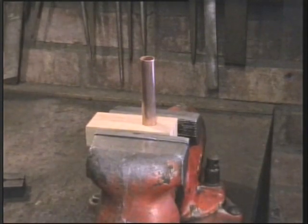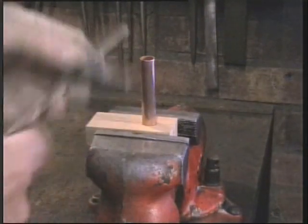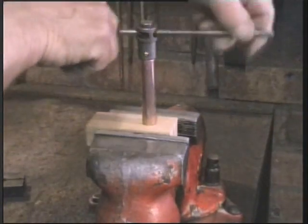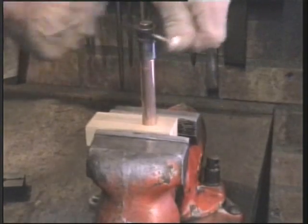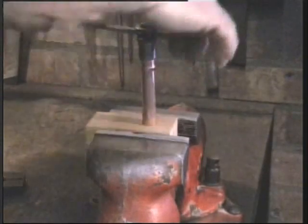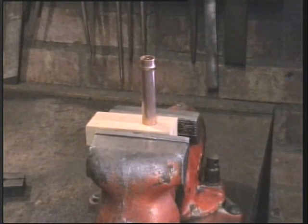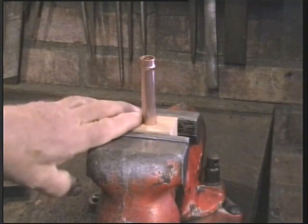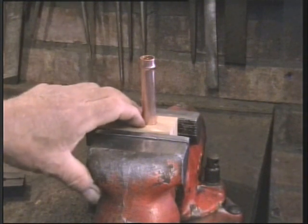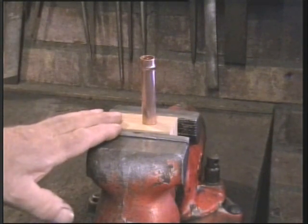And they come in at various sizes. Here's a little smaller one, just has one ball, and that's just simply dropped into the copper tube and turned. If I get my hands out the way, you can see it puts what would be an olive shape into the tube, and then that comes out. It's at this point you realise you forgot to put the nut on first, or you put it on back to front. So you've got to cut it off and start again.